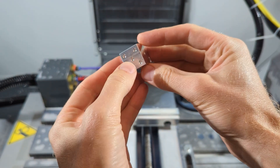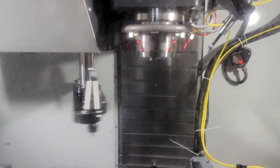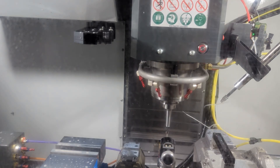Let's cut the patterns onto all six sides of our die, and let's do it in a way that is precise enough, but efficient above all else. First, confirm that your three tools — the center drill, the drill, and the chamfer — are loaded into the mill and measured.